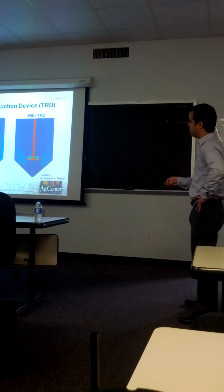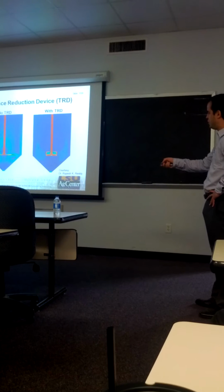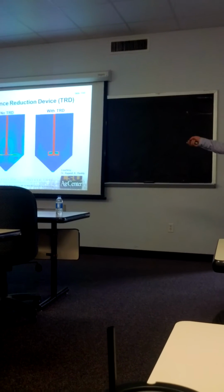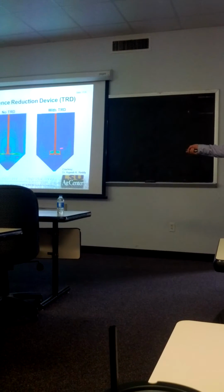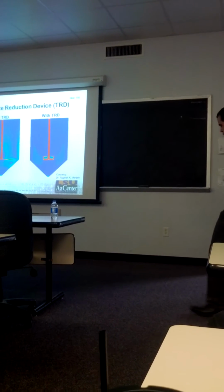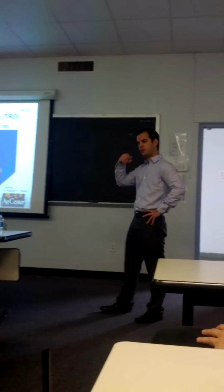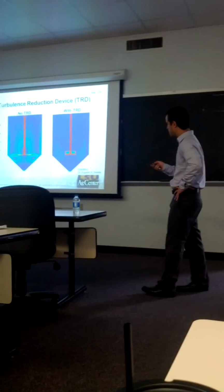Please observe that when there's no TRD, there are high velocities as well as huge internal recirculation. When the TRD is implemented, these velocities are reduced and the recirculations as well. This can lead to enhanced clarification and can probably lead to lower residence times.